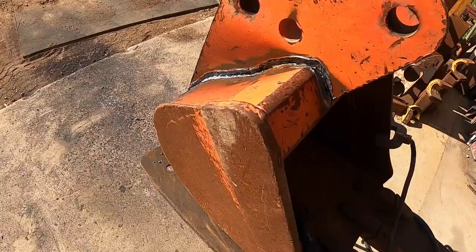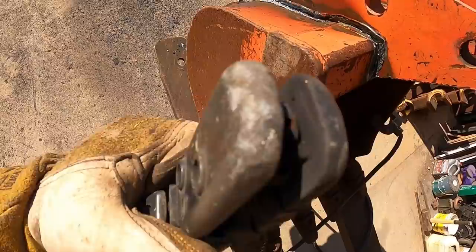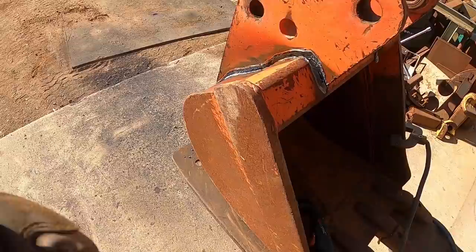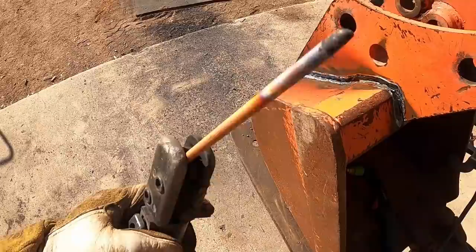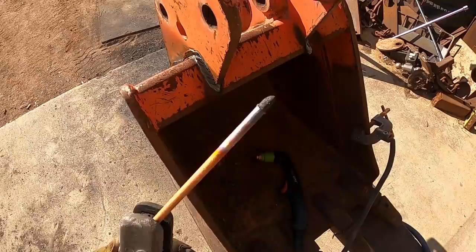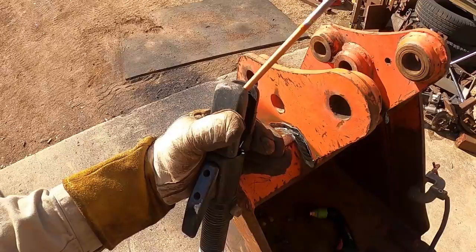I get asked often how this works. And what it does is, if you can see little air jet holes underneath there, that will blow the material away as you create the arc. I'm sorry I'm so shaky because I don't have my stand on me. But this is how it works. The air jets will blow the molten puddle away. Whereas here in this situation, I can access underneath that opening from there and there. So that makes it much easier in this particular case. So let me continue with this, and I'll give my final rundown of the two in a second.